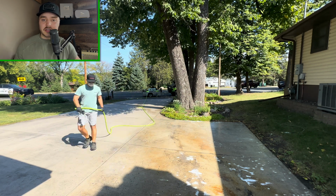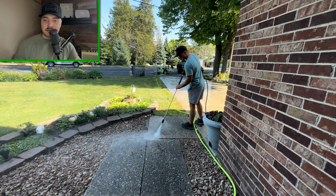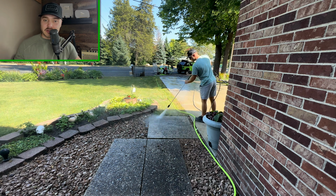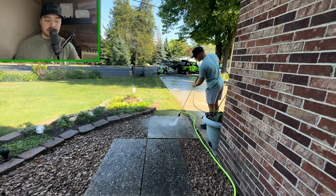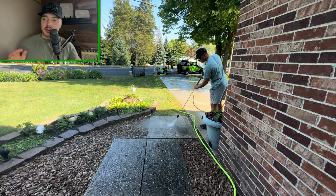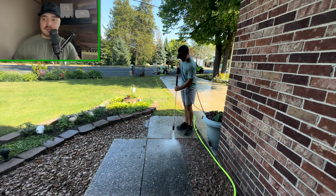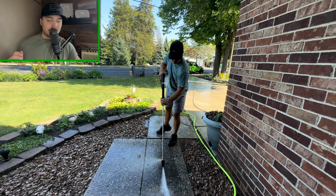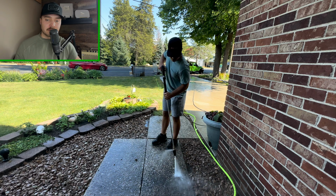All right, so the next thing you guys will see me doing is pre-treating the driveway with sodium hypochlorite. I sometimes pre-treat, but I always post-treat the driveway. Whenever it's super dirty, that's when I pre-treat. But I've kind of found throughout the years that you can only really post-treat and you'll get the same exact results. So sodium hypochlorite, if you guys don't know what that is, that's what I'm spraying on the driveway. It's basically a super high concentrated bleach. It's used for commercial work or for pools. You'll usually find this stuff in your pool store.